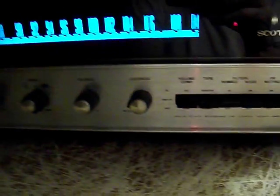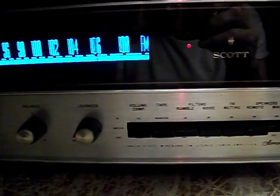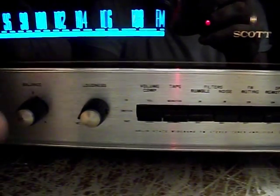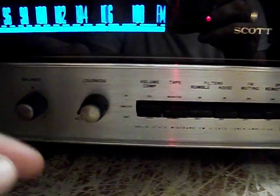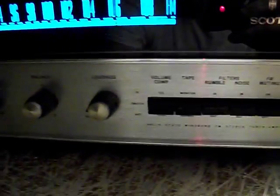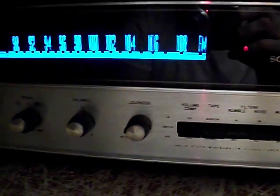Anyway, I decided to dig into it a little bit. This has a pretty straightforward multiplex setup — it has you tweaking one coil while measuring, dipping a voltage and maxing a voltage. It's not a big deal, that was fairly easy to do. I just used my Simpson 260, which is 20,000 ohms per volt, which is what it specifies to use.